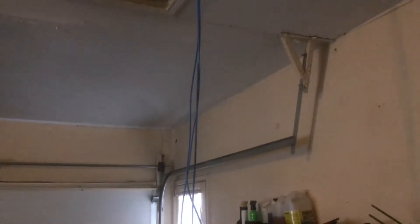I have all my cables all the way to the NVR and then all these ends are going to go out to the camera. What I'm going to do is pop a hole through the soffit where the camera's going to go, then stick the fish rod through from the outside, come into the attic, attach my cable to the fish rod, and pull it back through from the outside.